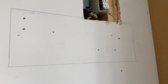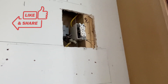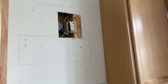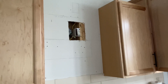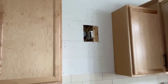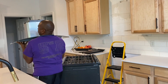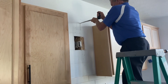I'm going to go ahead and apologize now because you will not see how this cutout square got here. I actually deleted the footage out of frustration. We thought we had secured reliable help, but that wasn't the case, so we decided we're going to start DIYing these projects. In our attempt to do that, we realized the framework did not have enough studs to securely mount the range hood, so we cut out a square to add a stud. That's when we realized the receptacle was also in the way and needed to be moved up so the range hood could fit flush against the wall.